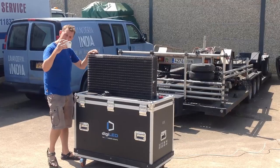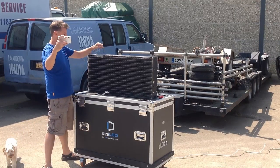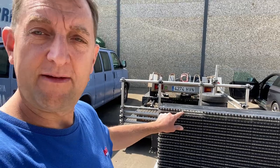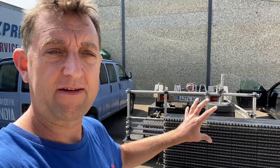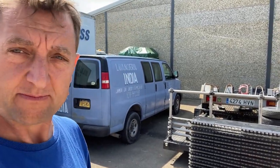The reason it was called DCM15 though was because even back in 97, 98, Invision had pioneered a virtual pixel technology. Now, I know a lot of people poo-poo virtual pixels, but they actually got it to work. And the reason it works is that the human eye is much more sensitive to brightness than it is to color. So if you can display brightness information on single LEDs and color information on whole pixels, you can actually do a very good job of simulating a screen that has double the resolution you think it should have.